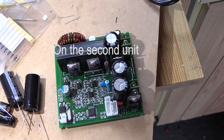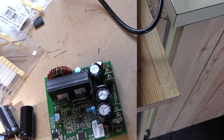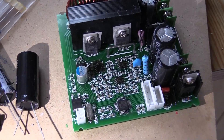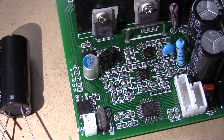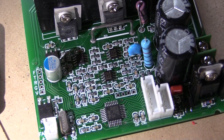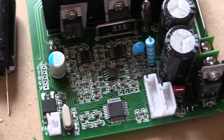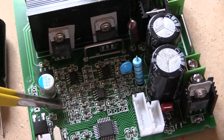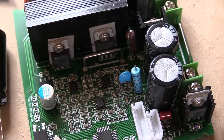Right, so this is the board — we've got the inputs up here and the output just there. I've got my phone as a light to help with some lighting here. The capacitors in question are the C23, C22, and C24. I'll just point those out: this one here, this one here, and this one up here. Those three capacitors need to be changed out to improve the performance.